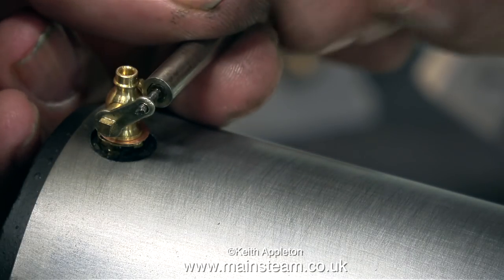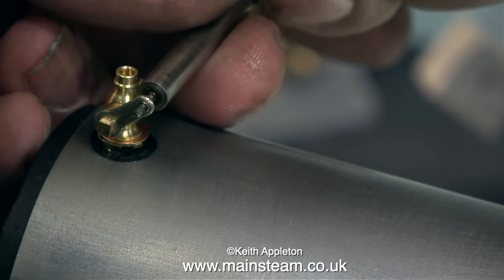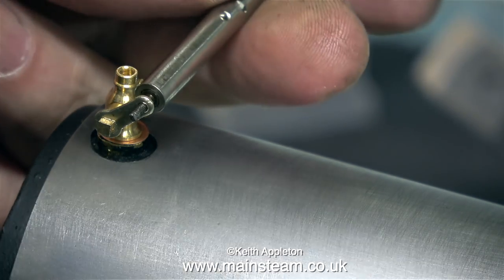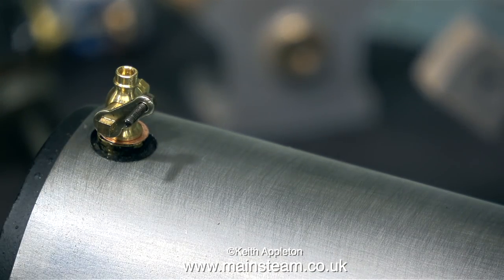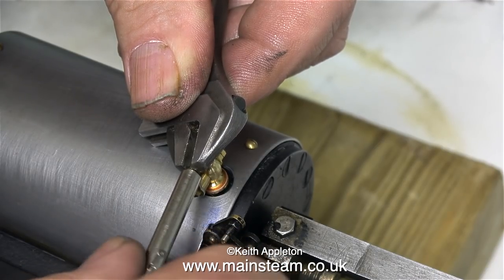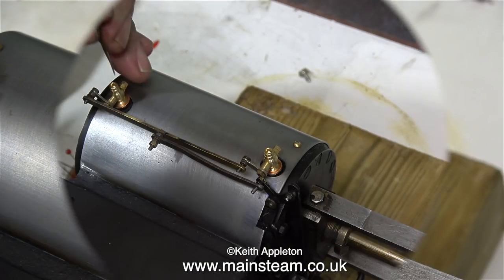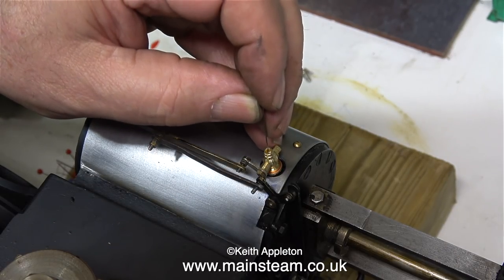I drilled out the holes in the levers on these drain cocks before I fitted them, so now they are sixteenth of an inch diameter holes, and here I'm fitting a 10BA bolt. These holes aren't threaded - it's just that they're a little bit tight, so I'm using the nut spinner to push them through. Now it's time to do the other side in exactly the same way, and I'm fitting the nut on the 10BA bolt. I did that at the other side but I forgot to video it. So I apologise for my incompetence - and please read that as incompetence, not incontinence.